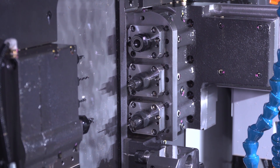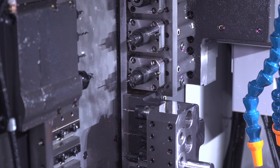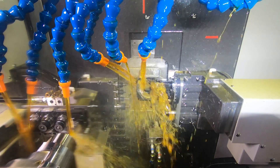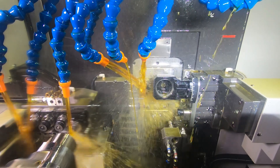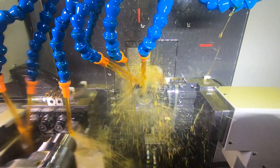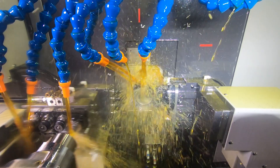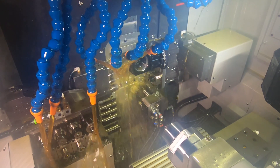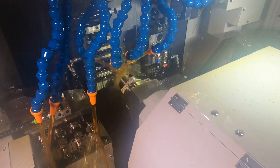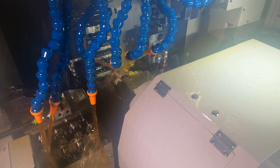The Sagami S206 Mark II has nine turning positions on the front and rear gang for the main spindle, plus seven milling units and five static drilling positions. The opposing gang slides are at the 3 o'clock versus the competitor's 12 o'clock designs, which helps to eliminate chip wrap and results in faster chip-to-chip times, as there's less distance to travel between tools. The four-position front milling unit is rated at 10,000 RPM and has one offset ER-16 that can hold up to a 30 millimeter diameter saw. The rear modular milling unit for the main is rated at 8,000 RPM and one and a third horsepower — the same modular units used on our 32 millimeter machines and some of our 38 models as well.